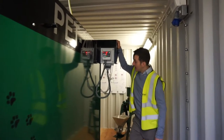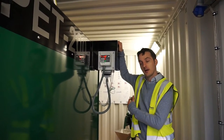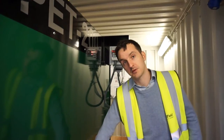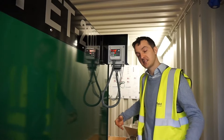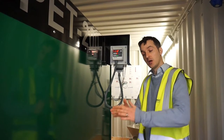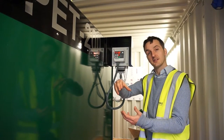The control panel is the hub of the machine. It will show the operator the times that we are into the burn process. It will also show you the primary chamber temperature, the secondary chamber temperature, and the hearth temperature. The hearth is a chamber below the primary chamber, designed to heat the refractory floor from underneath. This prevents any cold spots underneath an animal where it will be situated, and also provides combustion from two sides at once.